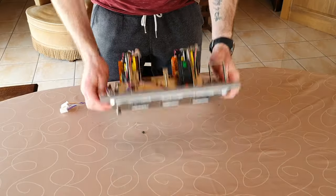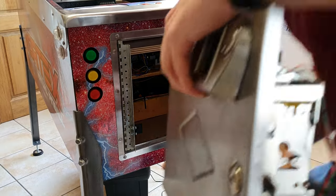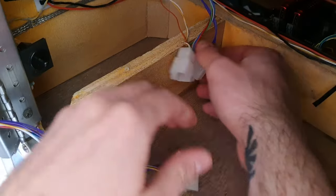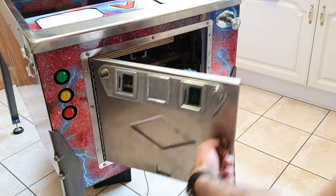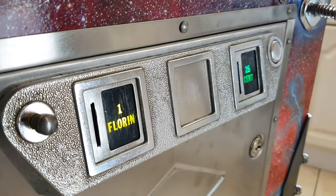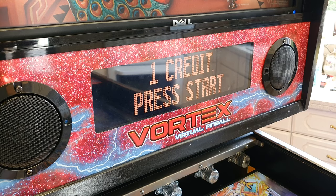I'm incredibly happy with the results after all this hard work. With the door now complete, let's finally install it in the cabinet. I put the door in place and install it with a couple of bolts through the large hinge. The new wiring harness conveniently plugs into two connectors inside the cabinet. The coin door can now be closed — it looks so good. I power on the cabinet and the lights behind the price plates neatly illuminate the plastics. I can put a coin in a slot to see a credit gets added. How cool.